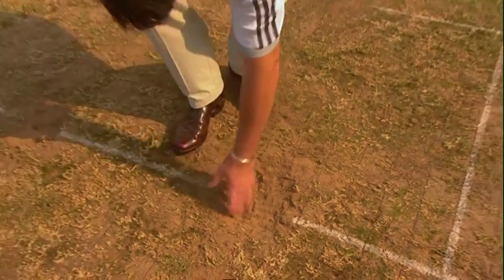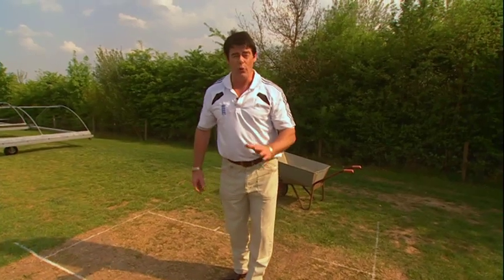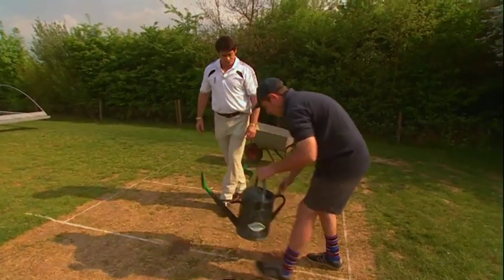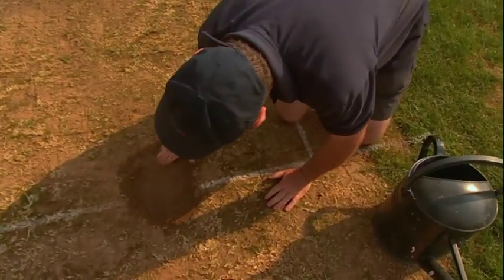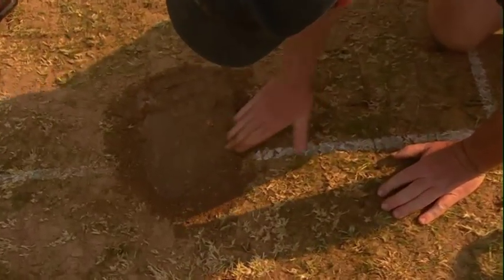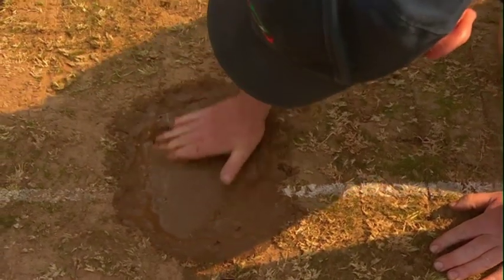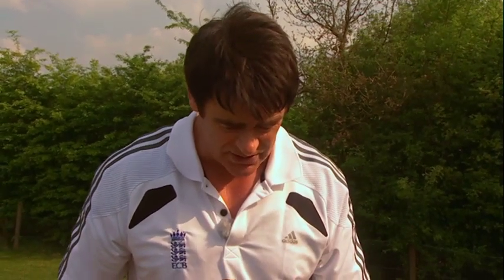Now we've cleaned out all the dust, Ian's going to put a little bit of water in these holes and form a slick with his hands to ensure that the bond is made between the filling compound. He's paying close attention to the edge, working it into a slick — he's really getting down and dirty here but it's very necessary. If you put too much in you'll have to wait; if there's any standing water this will not work. It's solely to form a bond, so we might have to wait until any standing water has disappeared.